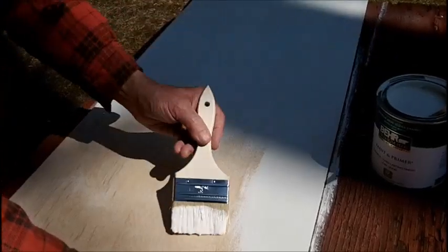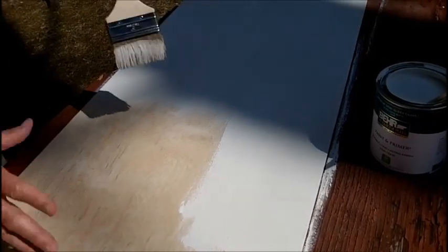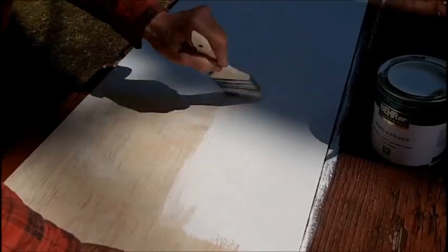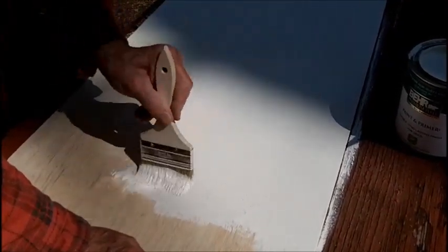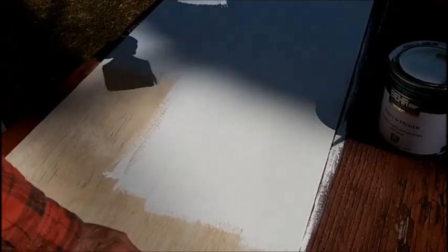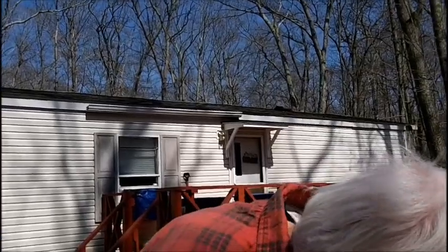I got the adhesive, which I think I showed you in the beginning of this video, that will hold most of this in, but in order to keep it in there, you have to put some nails in it certain places, or screws. The biggest issue is the tub surround plastic. It's very loose, and there's no way I can tighten it up unless I screw it in, because I can't stand there holding the adhesive and holding it up there until it dries. So if I can't get the white screws, I'm going to have to just nail it in, and that's it. Call it good.